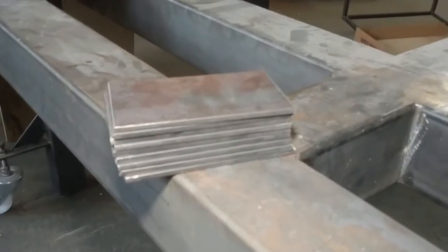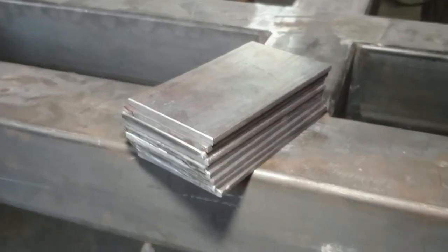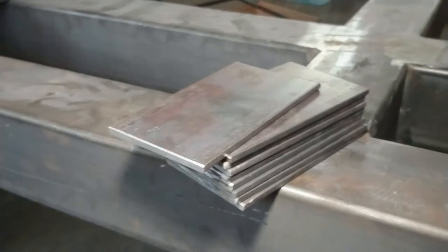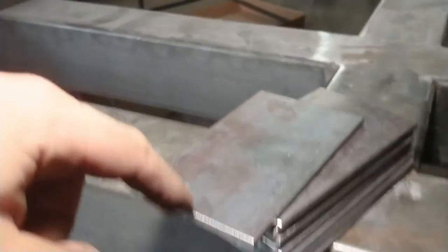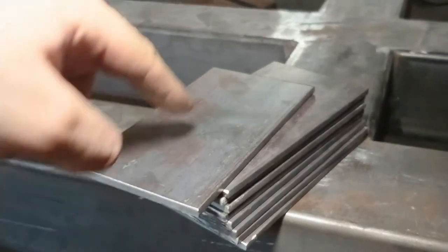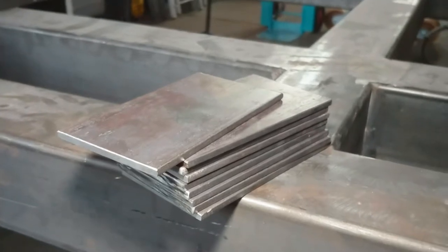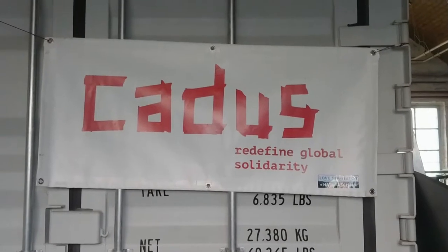These pieces of steel will become the counterweight for the suction box. I figure it should be possible for nearly everyone to get a piece of steel, 80mm wide, 5mm thick, and just chop it up in pieces of that length — this is 14.2 cm, 142mm in this direction. This together should be a 4.2 kg counterweight that fits exactly in the corner of the suction box. Thanks, Karos, for letting me use your tools.